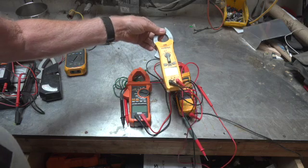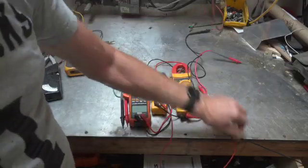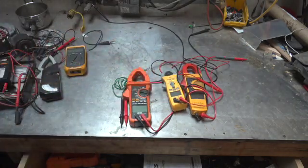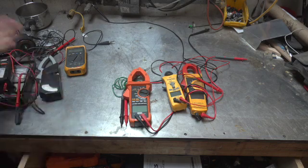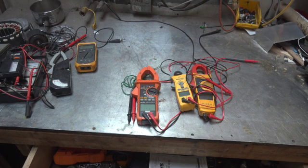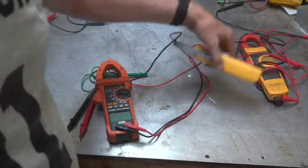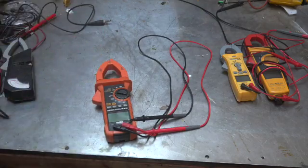The Field Piece is a little bit newer — that's a good meter. These are professional meters. This Fluke 333 is a professional meter, although it's pretty old too. What always bothered me about the cheapy meters in the past was they had poor quality leads. All meters had poor quality leads for a long time, but the cheapies kept the poor quality leads for an awful long time, and I would not consider them to be dependable. Professional meters had good leads and would last quite a while. Leads do fail on meters — they're probably the most failure-prone component.